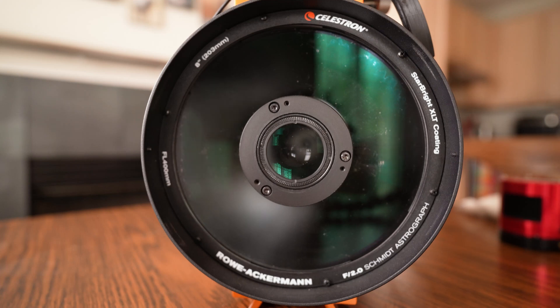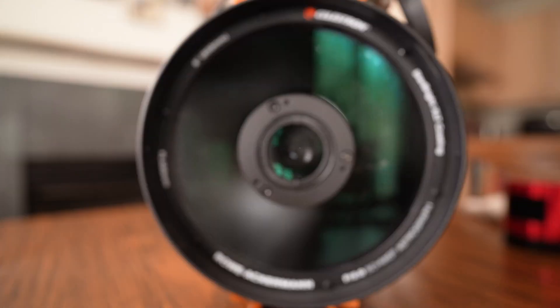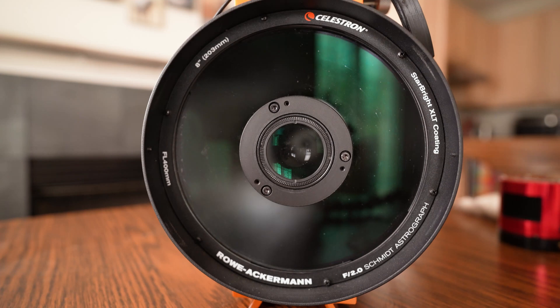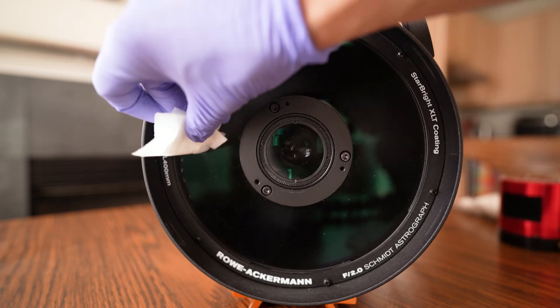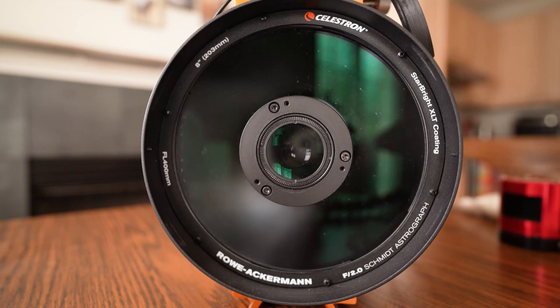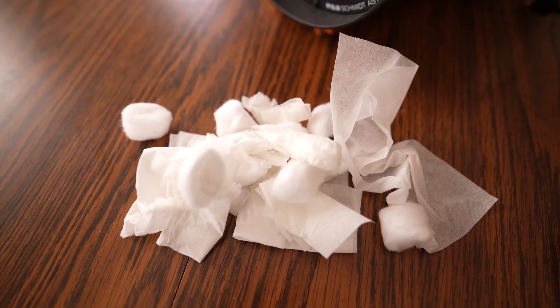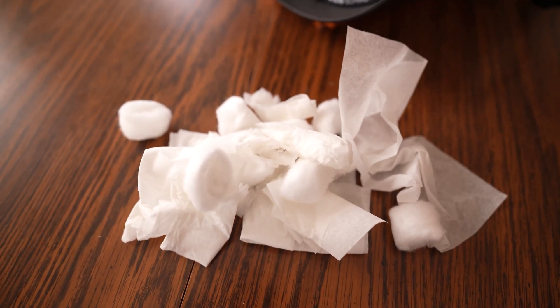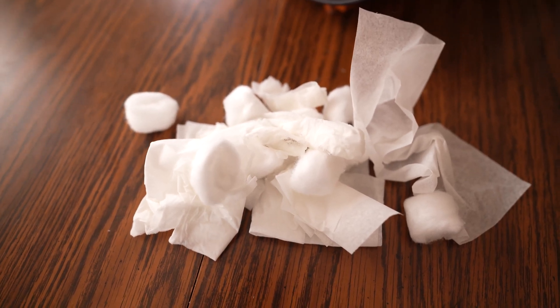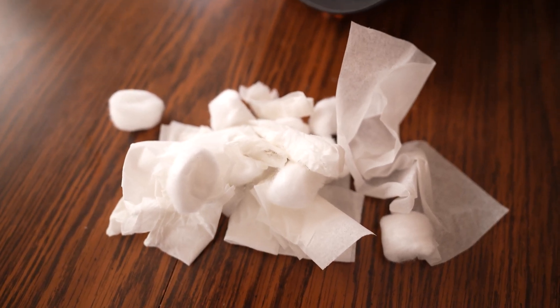It's very important that as you apply these touches, you're not really pushing against the surface. All you're doing is allowing the slight weight of the cleaning material — the cotton ball, Kim wipe, or PEC pad — to apply the pressure. It's hardly anything, basically a feather touch, in order to lift off the bits you're able to get off without too much interference. For any places where you might have left a little bit of liquid, use a dry Kim wipe to pick up that extra moisture. Always use a clean surface as you're contacting the optics, then rotate to a clean part of the cleaning pad.